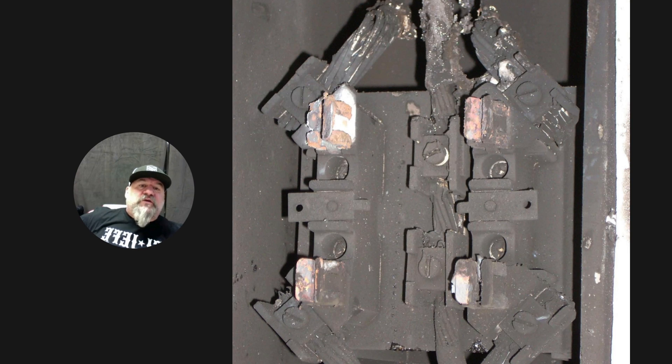Now this just looks crazy. It could have happened in the meter can — if I were to venture a guess, I'd say so. The wires look a little melted back on the line side. If a fire got that hot and scorched the inside of the meter like that, I'd say the house pretty much burnt to the ground. That's crazy looking.